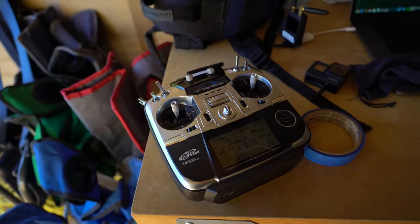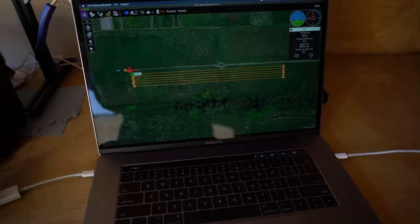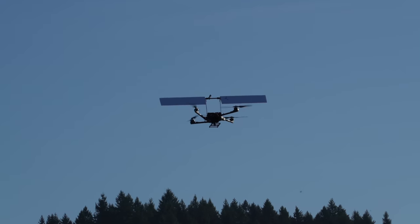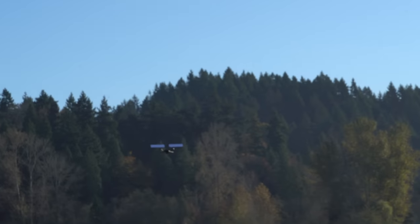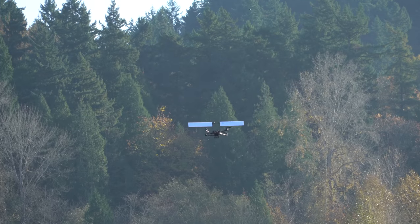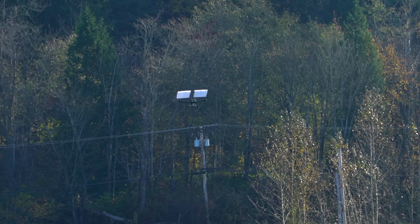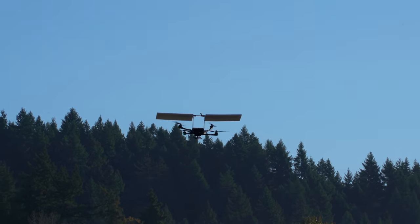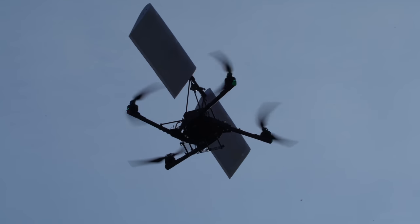That is wild. I'm going to be ready to throw this thing in position mode if something goes wrong so that it'll just stop the mission. The wing pitched forward onto the hard stops. So far, so good. As it starts going faster, the wing will be lifting up and back quite a bit, so the front motors will do less and less work as the speed increases. This wing has a lot of drag when the aircraft is pivoting in a turn, making the flight controller have to fight harder to hit its angular rate set point — a little less elegant and a little more terrifying. These are 33-inch propellers, so having something this large and powerful go unstable is no joke.